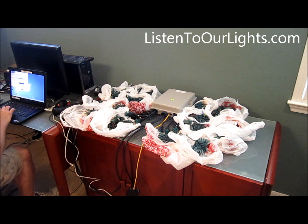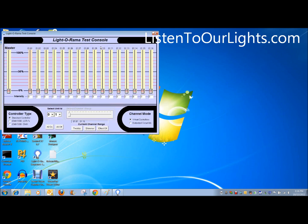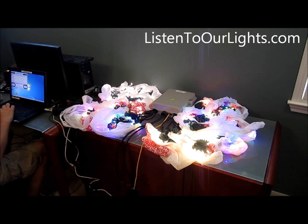So we come here and we have COM port — it says it's found on COM port three. Now I want to go to the console and I select the unit ID that I have, which is unit two, and I say all on. They all turn on. Now if my unit ID was set improperly, these wouldn't turn on. So that's another thing I'm checking for. First test is turn them all on.